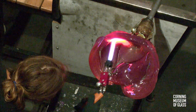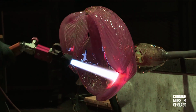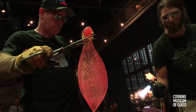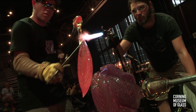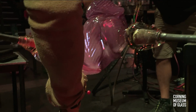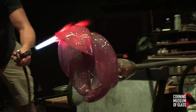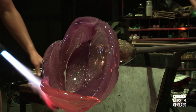Absolutely, yeah. For all of you listening out there, the question is: is it possible to heat the glass so much that the pattern they've created and pressed into it disappears? And it really is. Glass naturally, when you heat it, just wants to condense. It wants to ball up and lose all of that definition. Once the petal or the leaf is on the piece, we're typically not going to get it so hot that it would lose definition. The really hard part is once you've pressed the glass with that tool to create the pattern, you have to keep the core temperature in it, because once that cools down, you have to heat it up so much again to reheat the core so that it's malleable and workable, that you'll lose that surface texture. You're welcome.